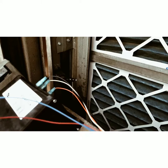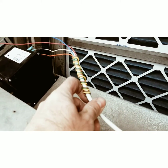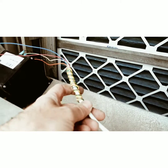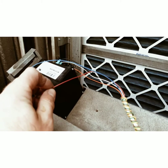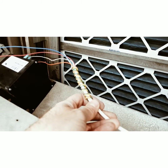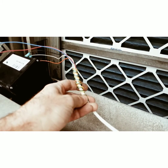Three wires go to the motor for the actuator: we've got 24 volts, common, and our DC input. Now I ran eight-conductor for a reason — I had it in my truck, but I'm glad I did. I like to use extra conductors because if you have a failed conductor at some point, instead of running all new wiring you can just use one of the spare conductors that you've left for yourself on either end of the wire. Don't cut them off — coil them up nice and neat so you have them for the future.